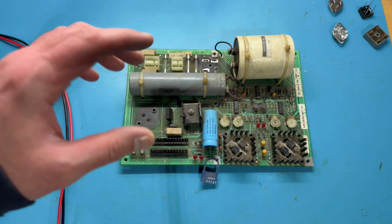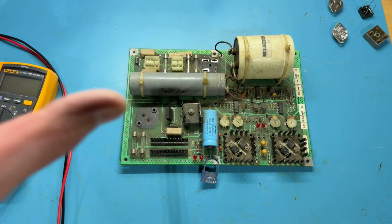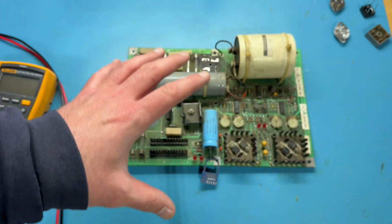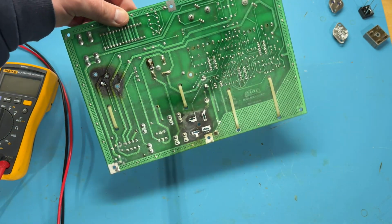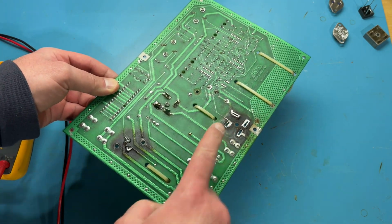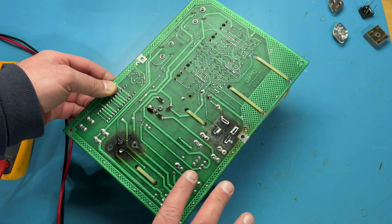Okay, I spent some more time going through the manual, and it turns out that the fuse that I keep blowing, F3 over here, the manual says that that's designed to protect against short circuits. So I pulled the PCB out of the transformer assembly off of the plate, flipped it around, and immediately noticed, this is BR1 over here and Q5 over here. Really, really, really bad scorching.